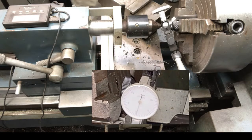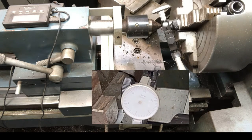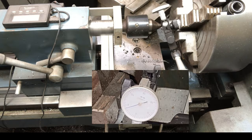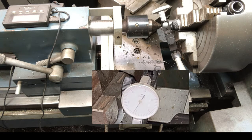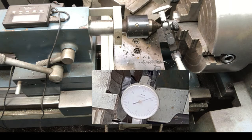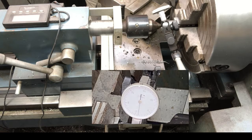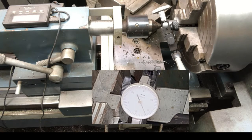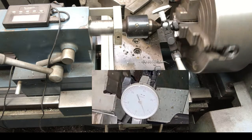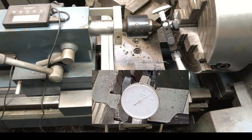With our brake roughly set into our four-jaw chuck, we'll use a dial indicator to dial it in within a half-thousandth of an inch. To dial in a four-jaw chuck, you move each jaw individually. I like to move the jaw that is on the same spot where my dial indicator touches the piece, so you can see whether you are moving the dial clockwise or counterclockwise and can loosen or tighten each jaw as needed when you rotate it around.